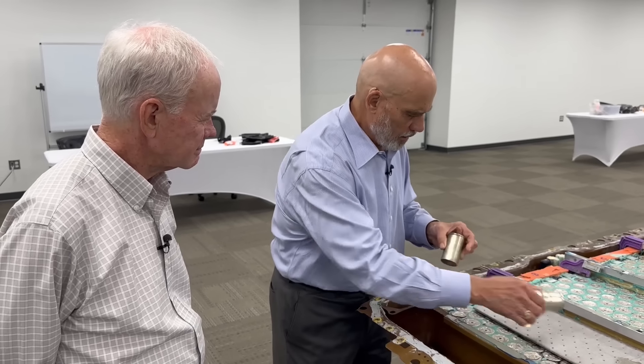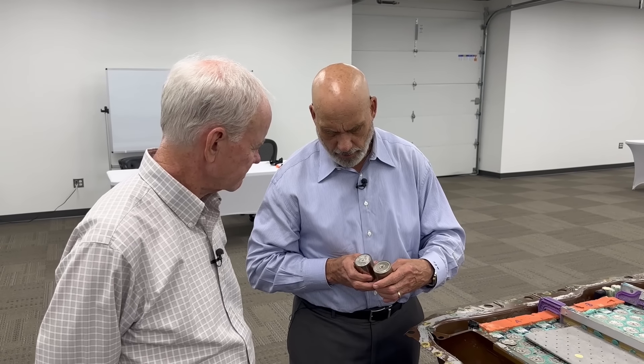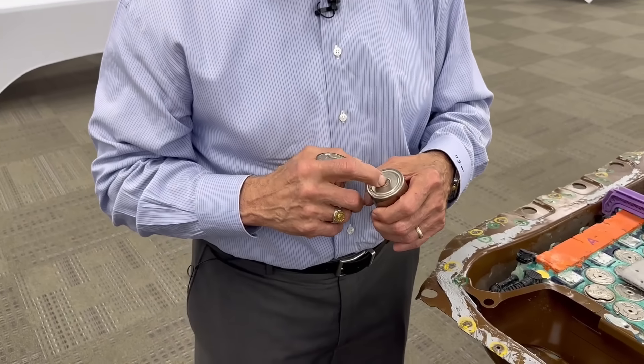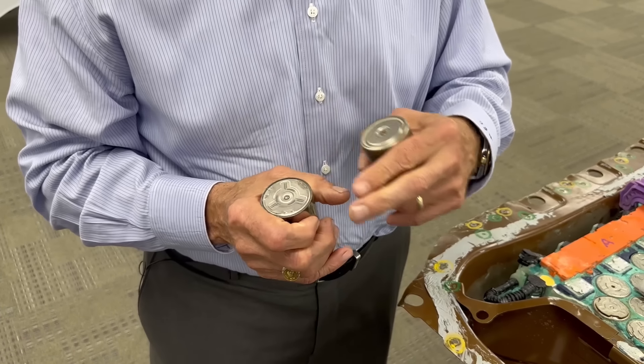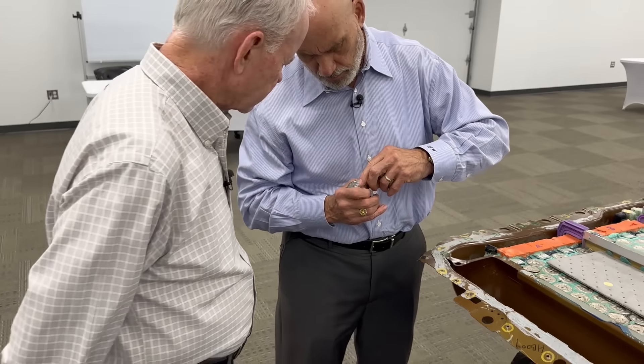When we get the battery out, one thing we notice is that this is the Cybertruck cell and this is the Model Y battery — and the end is different. The old design has a vent: if it gets hot and has to vent out, there's a vent here, and this was crimped in place. This is a different design with staking to get that vent in there. You can see some staking happening here — banging, hit hit hit. So it's easier and quicker to manufacture. And then the vent is like a little BB, so it just kind of blows the BB out and vents anything that's bad in there.